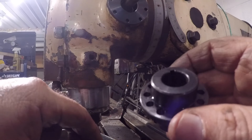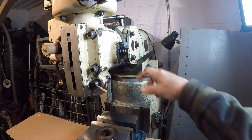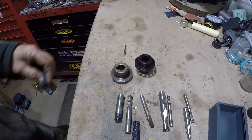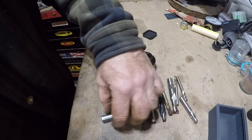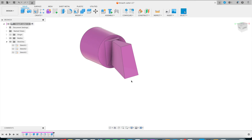So in this video I'm going to make a keyway cutter to cut this keyway to match. I go to my box of broken and worn-out bits and take a 3/16 end mill and grind a cutting edge on it. Hopefully this is what it's going to look like when I'm done — I'm just grinding 10-degree reliefs on the bottom and the sides.